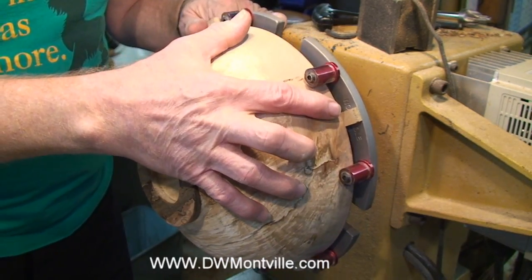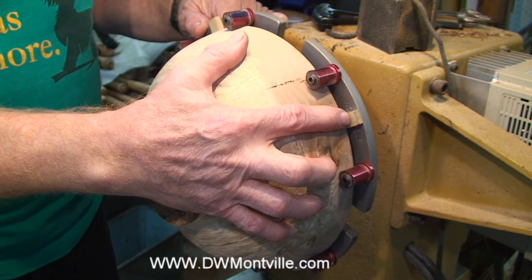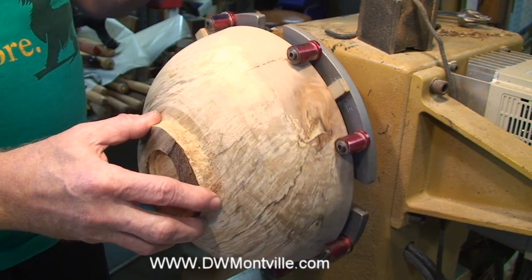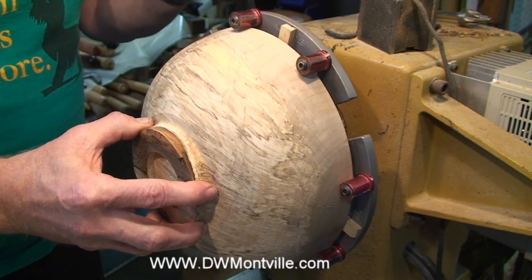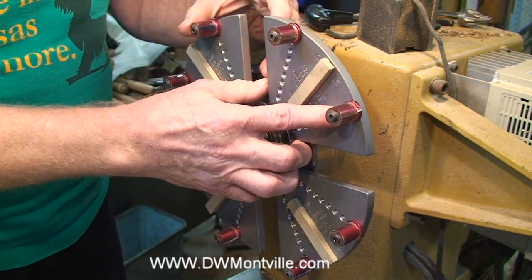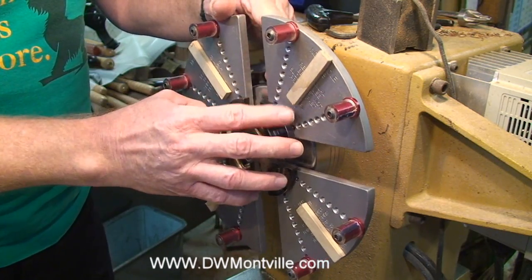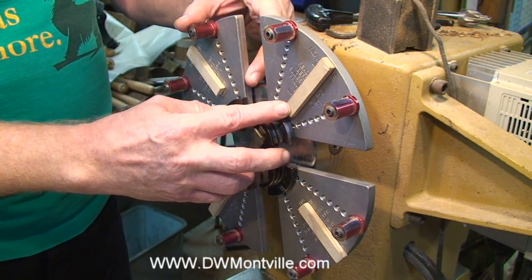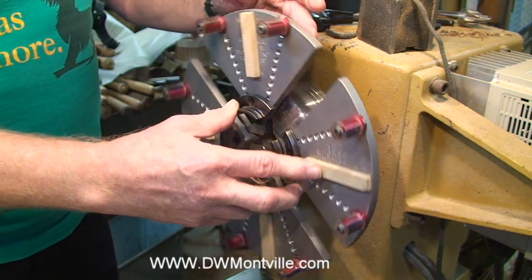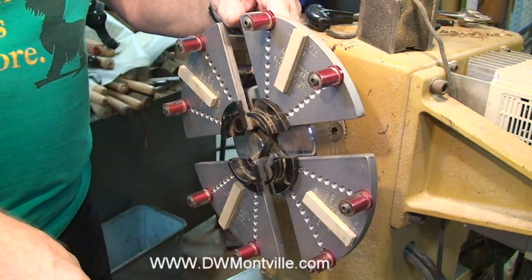The way you make these is really simple — I do it on my table saw. You rip a strip of wood off a board that is maybe a half inch or three-eighths thick, then about a quarter inch wide, which will clear the lip on the gripper. Those are approximate dimensions, and honestly the exact dimensions don't matter. The key point is they all have to be identical. You cut a strip about a foot long, cut it into four roughly equal pieces — accuracy is not important — then put double stick tape on the back and put them on. You're good to go.